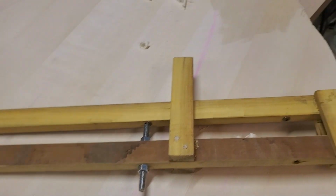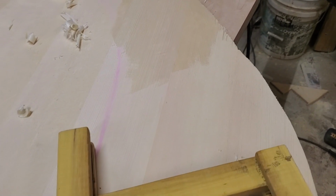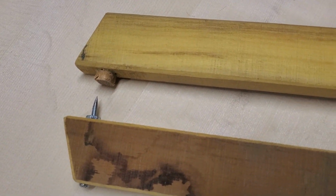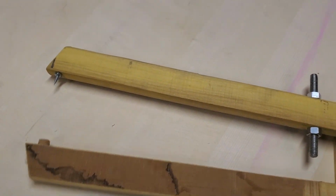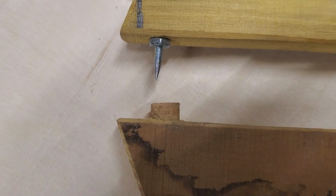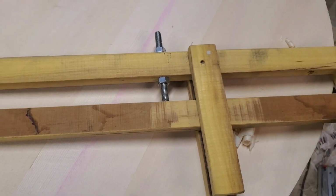So when I do the tapering, I do it by hand with the hand plane, and I know how far to go, because before I start doing that, I use this tool here that makes holes at a certain depth, and that I set. And believe it or not, this is a very old tool. It's the very same tool Stradivarius used. It's very effective for setting, there's a gap right there. So you set that gap, and then you punch a hole in the soundboard, and then you plane until that hole's gone. You're right at the depth you set. Pretty clever. And so I made a big one.